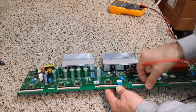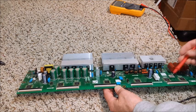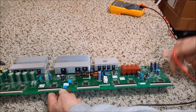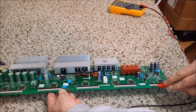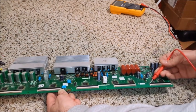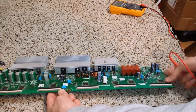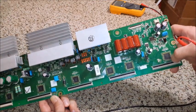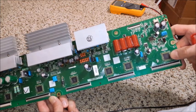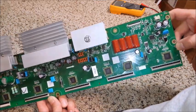Relatively simple. On the last one — you hear that beep? This is bad, we have an issue here. Now if we actually trace the circuit traces that connect where we heard the beep, we can determine which IC is bad — which I already knew before I started this. It's this one right here that is bad, and this will be getting fixed later.